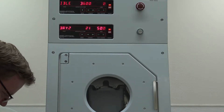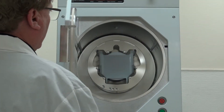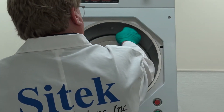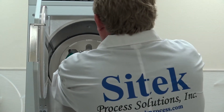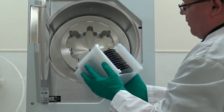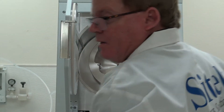I'll open the upper door now. I first like to feel for the hot nitrogen — nice and hot. On an AD300 system there's nitrogen and water on both sides, but all the smaller tools only have it on the right side when looking at the tool. The wafers look nice, the cassette's warm — that's good. I'm going to take this cassette out because we'll need it for the other machine when I do the demo.